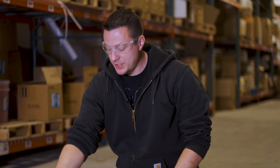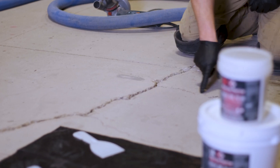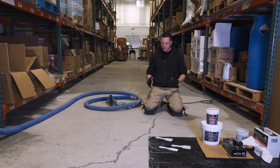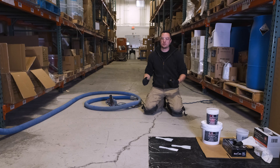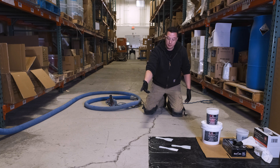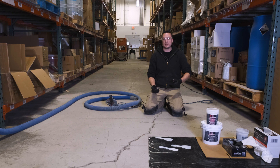You can see we just did a little bit of a cut here and here. There are also a couple of hairline cracks, some larger cracks, and a crater going that way — a couple of different ways to fill cracks. Always make sure it's fully prepped. If I was only grinding this floor, I would not want to just smear in my gel here because that's not properly prepped. However, if I'm shot blasting the whole floor — grinding and shot blasting, or just shot blasting — going over this with a shot blaster would clean out that crater and at least prep the surface, even if it's jagged and not cut. In that case, I would put my gel into that.